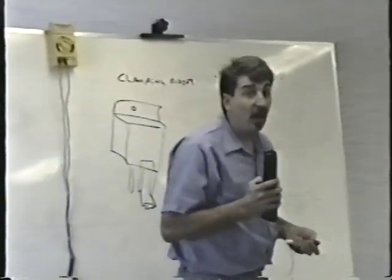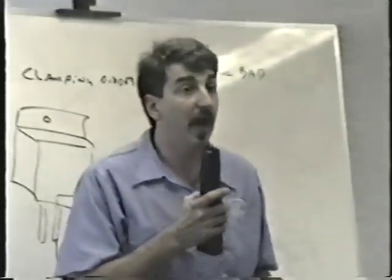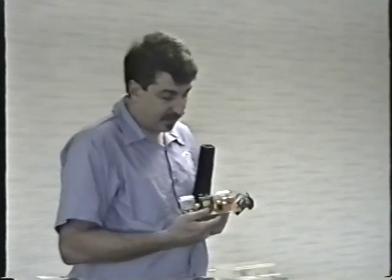There's one more thing that can cause the fuse to blow, and that is the bridge rectifier, or the four diodes, depending on what you have in your particular power supply. Now, a lot of times what happens is people find the fuse is blown in a power supply, and before they try finding out which parts are bad, they simply replace the fuse, only to watch it blow again. That will take out the bridge rectifier if you do that. If you get to a power supply with a blown fuse, like this one is, like Wayne's is, we need to check some things, and what we need to check is the transistors, like I just did, the clamping diodes, and we need to check the bridge rectifier.